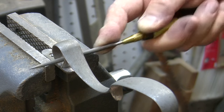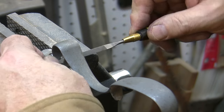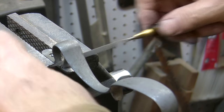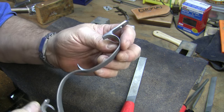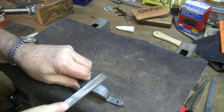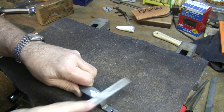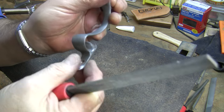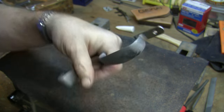This is what it takes to get into a tight curl like this - it really takes a very fine, very sharp file. We've got the inside of the trigger guard all polished up now. We've got to do the same thing to the outside, so once again I'm just going to get busy filing off the scale. We'll get out any pits we find - there is a pretty good pit right there that's going to have to be filed out. So we've got some work filing and then polishing.